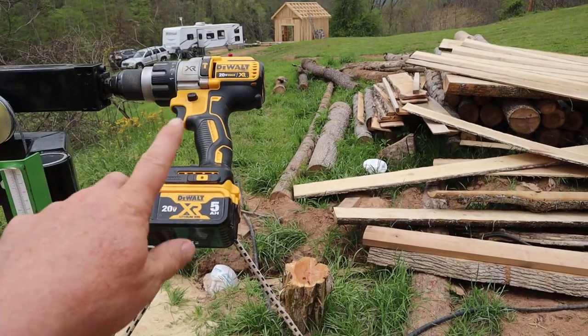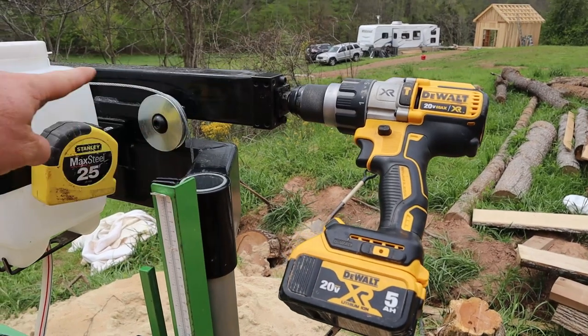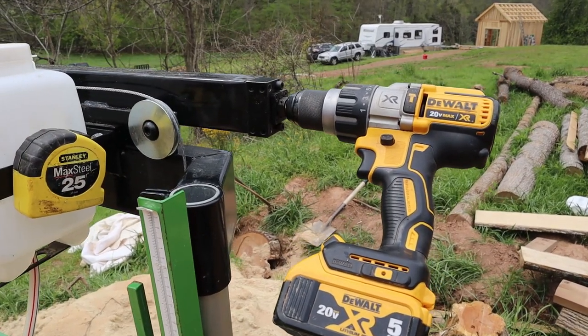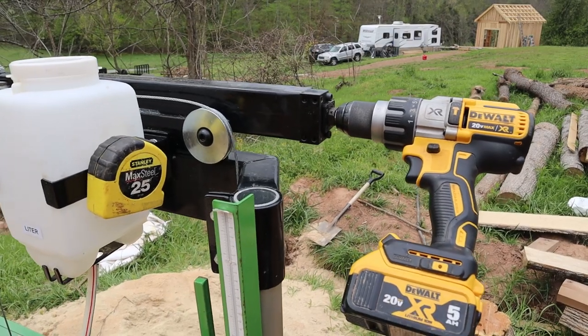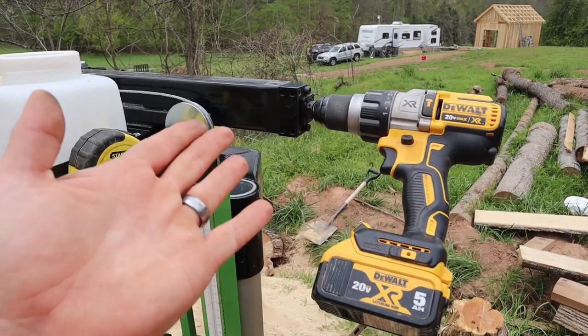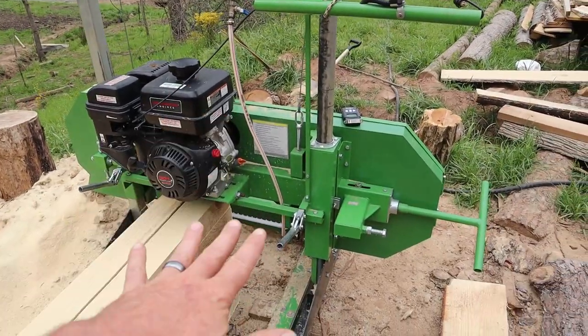We don't have the hand crank thing. We use the drill after the modification of this piece that broke inside of here. The lead screw, we replaced it with a ball nut, so it works a lot smoother now. But the problem is there's no friction, and if nothing is holding that thing in place, the bandsaw, if it is left unlocked, will come crashing down.